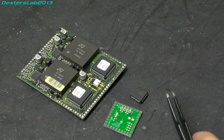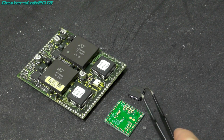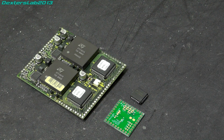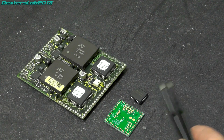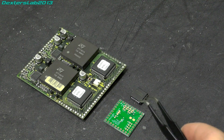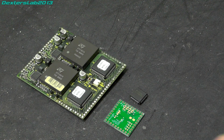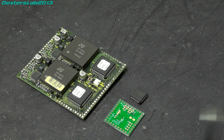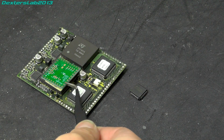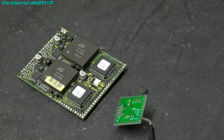It's the CLC020. Now this isn't actually a current product, it's discontinued now, unfortunately. It was an expensive device at the time. I think they were about £20 each, which is a huge amount of money. But I did a bit of looking around and actually found a Chinese seller selling new old stock of these for £5 each. Given I'm not going to need a lot of these, and the seller has plenty available, I thought this was probably a good solution. So I bought 2 of them, and we've also designed this PCB, which is going to sit in place of the 1601 and do the SDI conversion. There's not really much else needed on here apart from a few passives.